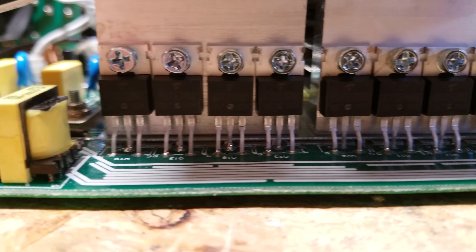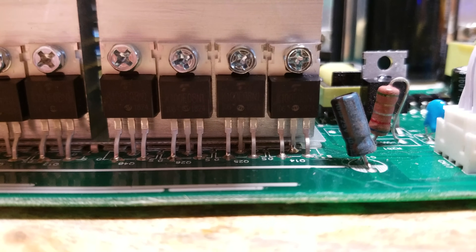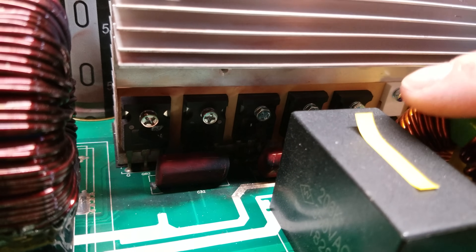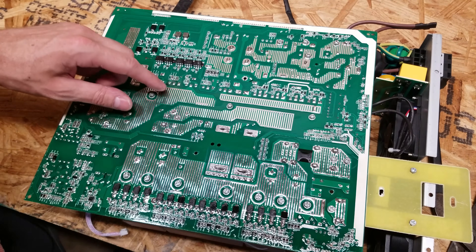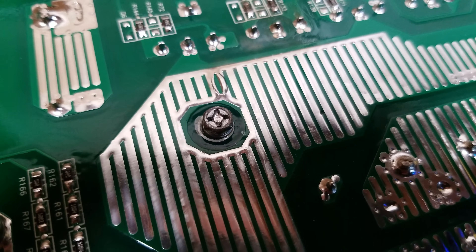Looking at what would be the left side of the inverter, I don't see any damage on this side. All of these transistors look perfectly fine — of course you can't always tell when they're damaged by visually looking at them, they need to be tested. We can see down in here where these transistors are busted out, and they are blown pretty good. In order to get to those, we are going to have to remove this larger heat sink, and to do that we're going to have to remove every one of these screws off those transistors. There are also three screws on the bottom holding that heat sink down. One screw has something in the head — I think it's just a defective screw, so we'll have to take that one out with a pair of pliers.